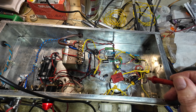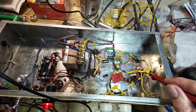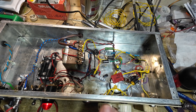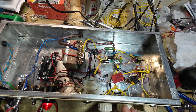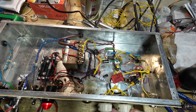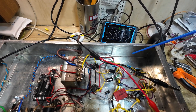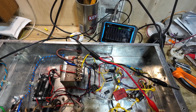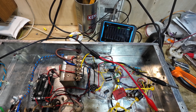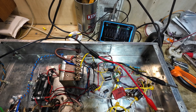Let's see what's cooking with this 6J8 then. We've got 148 volts on the plate and 112 on the screen — good enough for me. Wow, that's night and day from what it was before. It's absolutely silent when you turn it down. I've only got it on a smaller speaker mind you. Got the scope on it — we've got about 9.8 watts coming out of this amp. I had a few problems I had to sort out but sorted those — nothing major. Wondering if we can get a bit more out of it.